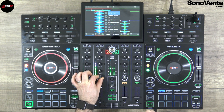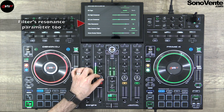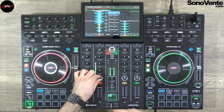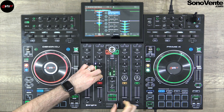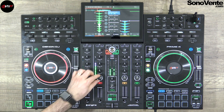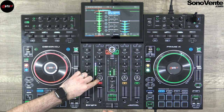The sweep FX include: filter — you can manage the filter like that; bleed — you hear something through; kill — you have nothing on the side of the filter; echo — a little echo; and a lot of parameters. It's post-fader and post-crossfader if you choose those little switches. There is also a bigger echo called 'wash' — very long when you push the knob to the side.